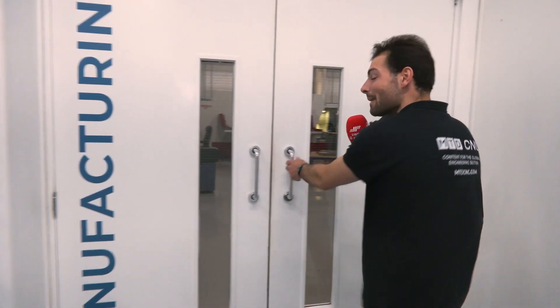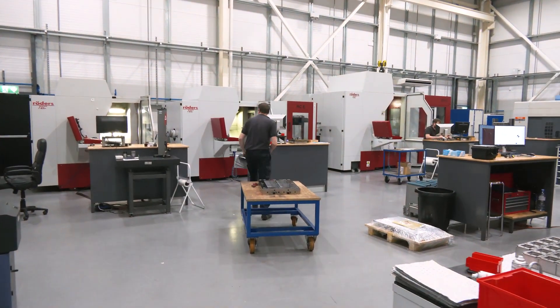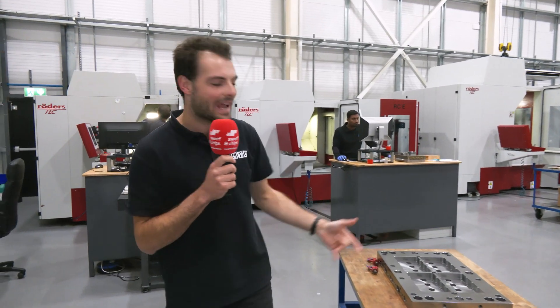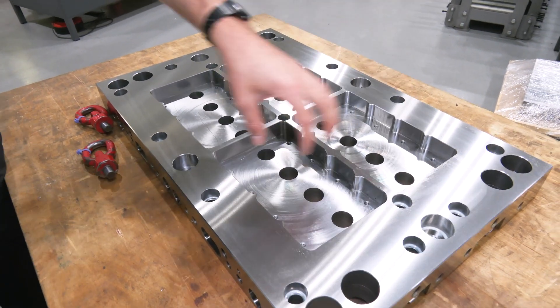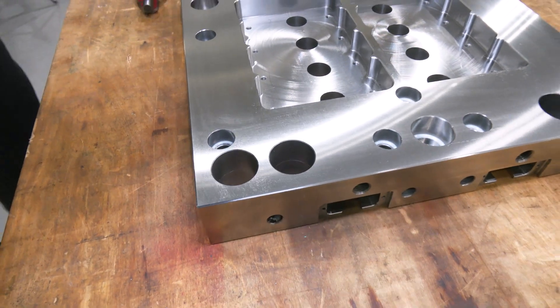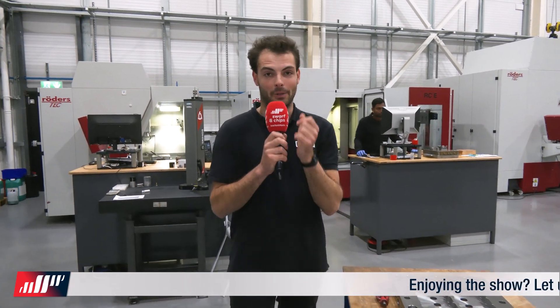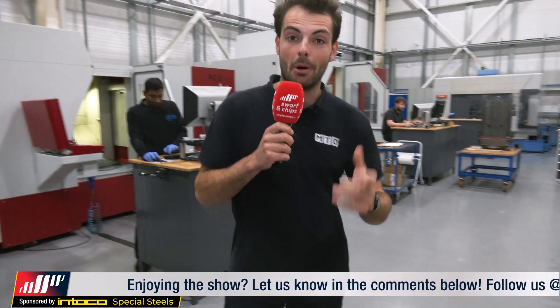We're now in the machine shop. We've got quite a few Roda's machines here that do lots of different jobs, but before we talk about those we need to talk about the mechanical layout of a mould tool. This is what's called a bolster or an outer — it basically holds all the business parts, all those inserts that have the forms that make the plastic components. It also has holes that need to be very accurate in diameter and in XY tolerance, holding the alignment pins that keep the two mould halves aligned. There are also inserts, ejector plates, and lots of different parts in the stack-up.